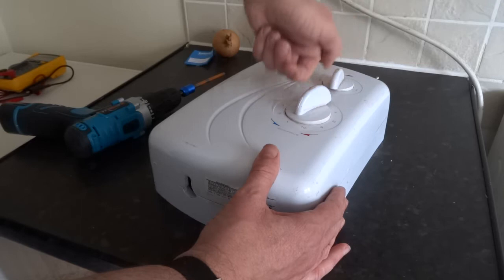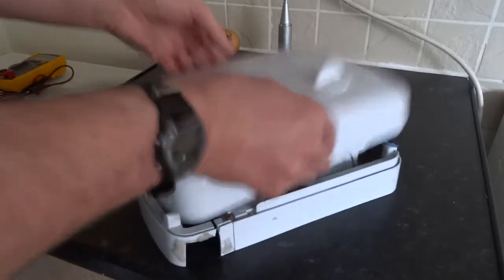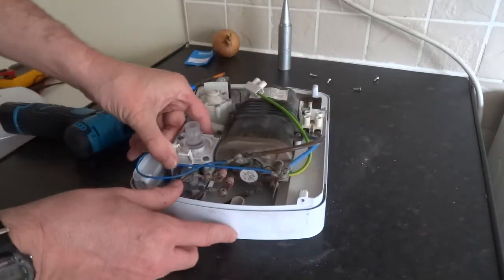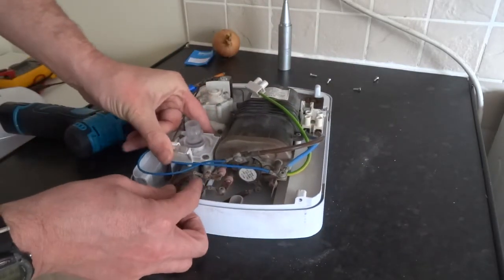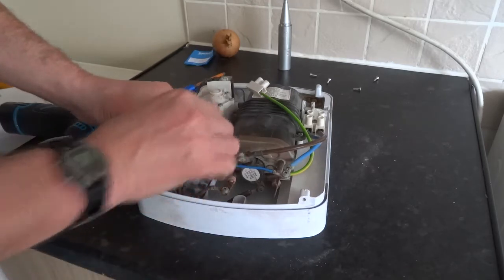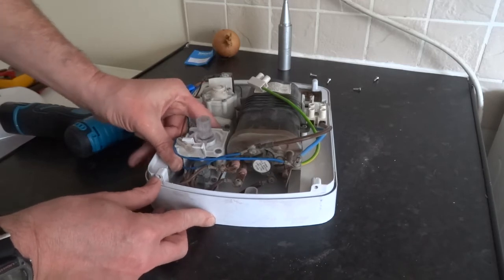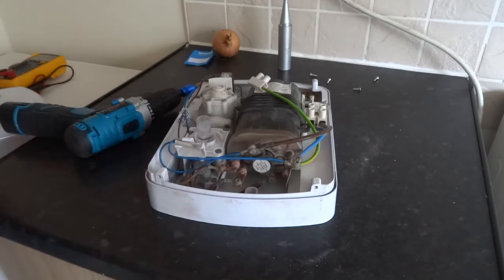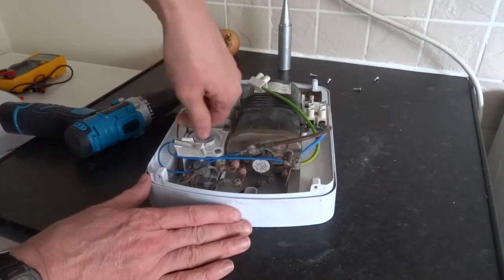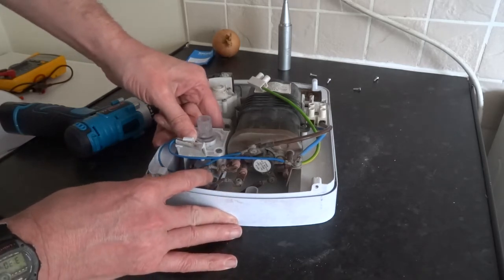You can actually see when it's in the off position by pressing the marker switch — if none of them want to come down, you know it's in off. Click it again and it should connect on one terminal, so it's operating just one element — that's economy. When you click to high and press the pressure switch, it should connect both micro switches, so you're in high.